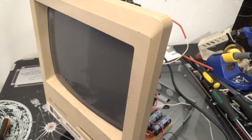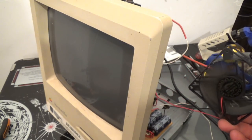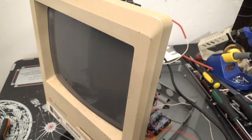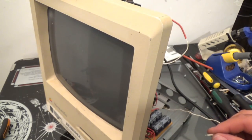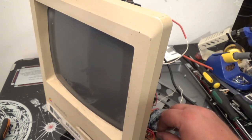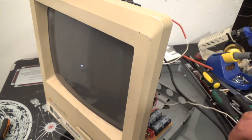Okay. So turned on, our cooling fan is spinning. Remember that 12 volt regulator? Okay, so now I'm going to ground out the gun. Well, give power by grounding it out, if that makes sense. Oh yeah, we got a dot in the screen. So now, that means we have a working Z amplifier.